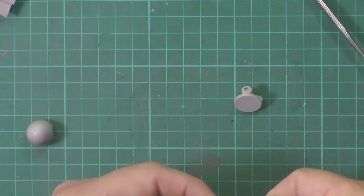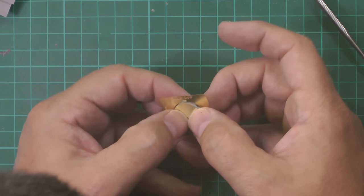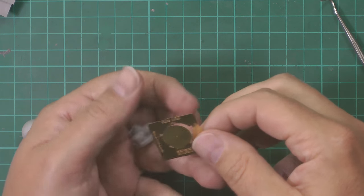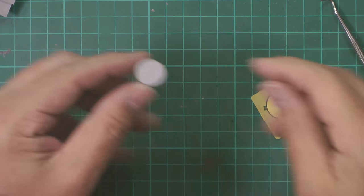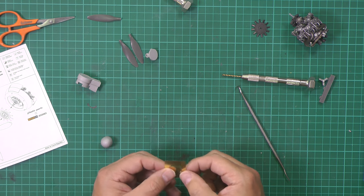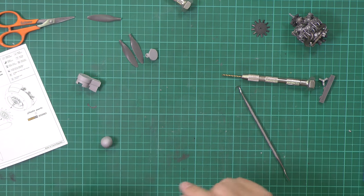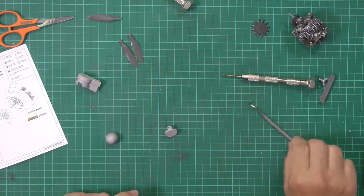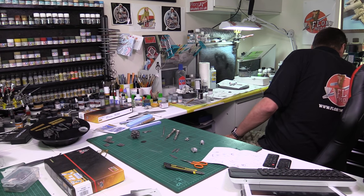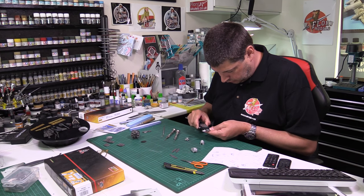I've had to borrow this template from another set I've got lying around, so I've bent some down to pop it on here and it sits on there just like that. We're just going to use a needle to give this a nudge into the soft resin to get a little spot on the inside. The callout is for a 2mm by 6mm hole, so just grab the calipers. We're going to put in six millimeters, screw that in, and then tape our depth on here.